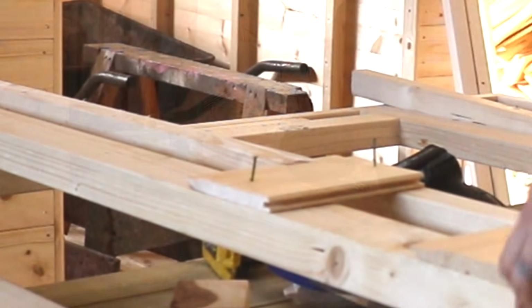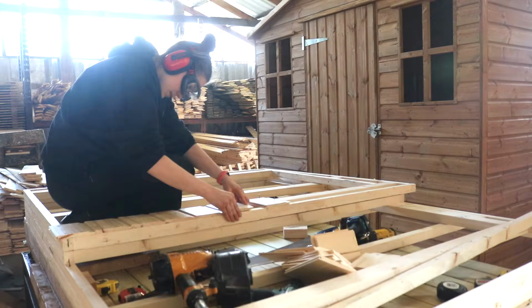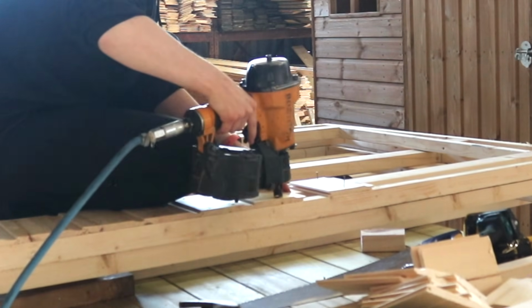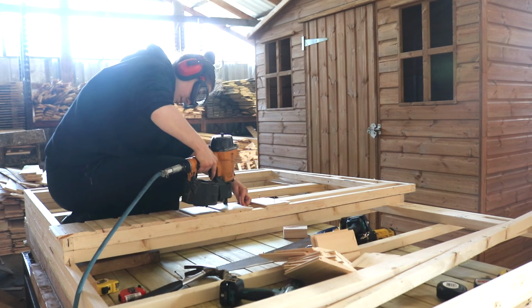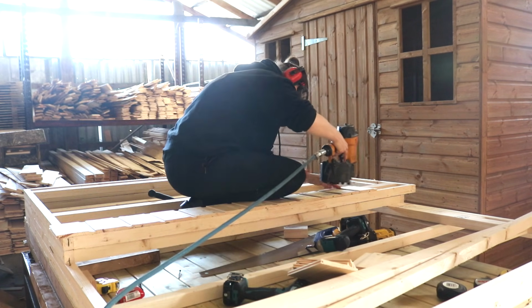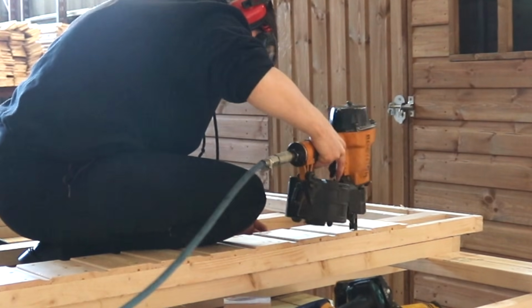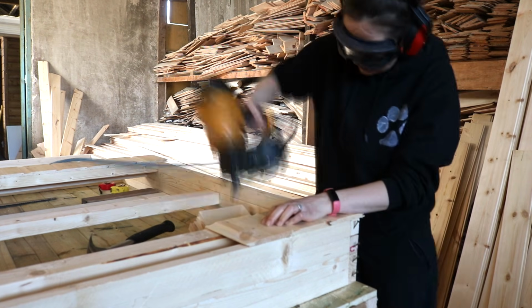And that first piece also needs to be overhung, and that will act like a skirting around the shed base. Make sure they've all slotted in properly so it doesn't affect the rest. That's something that I now always get obsessed with from previous mistakes. And after removing the temporary one and getting towards the top, I'd stop where I'd need a long piece to run across the top and then repeat on the opposite side of the door until I was ready.